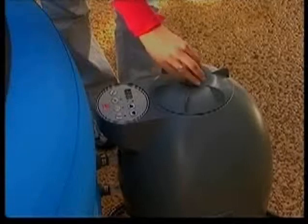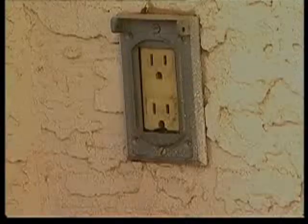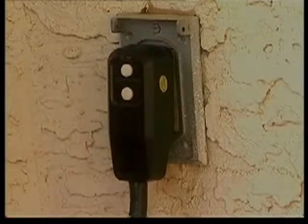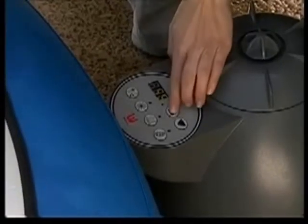Reach into the spa and retrieve the three stopper caps, allowing water to flow into the pump, and bleed the air purge valve as previously outlined. Plug in the pump following the testing procedure for the RCD, and set your desired temperature.